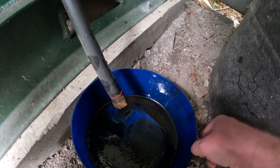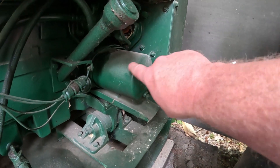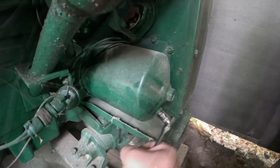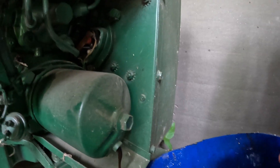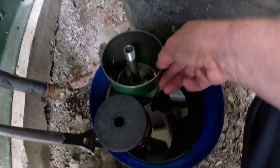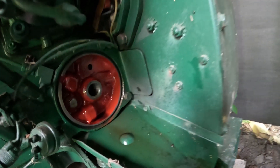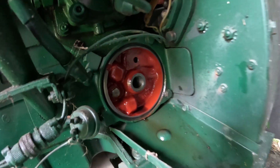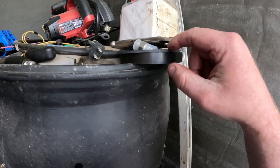We've got our oil drained out. Now I'm going to pull the drain plug on the bottom of the filter canister to get it drained so we can get the canister off. We've got our filter out — filter housing's clean, filter's clean, nothing crazy. As you can see, this thing is spotless under the filter. It's hardly got any hours on it. We'll go ahead and get this o-ring fished out and see if the o-ring that came with the adapter will fit.